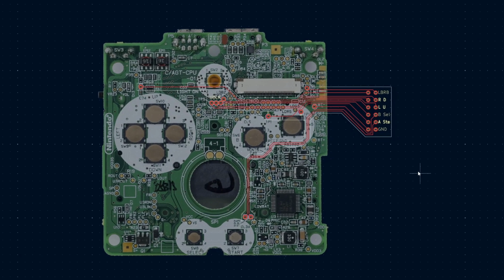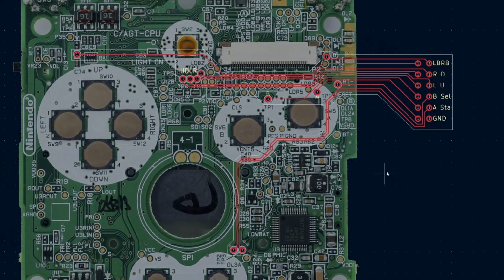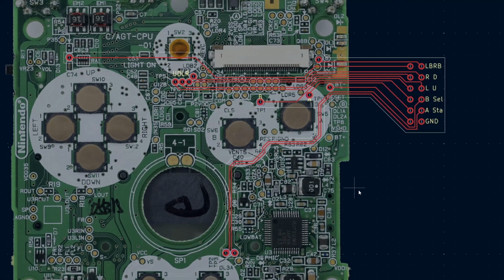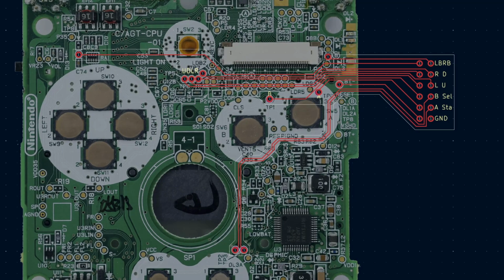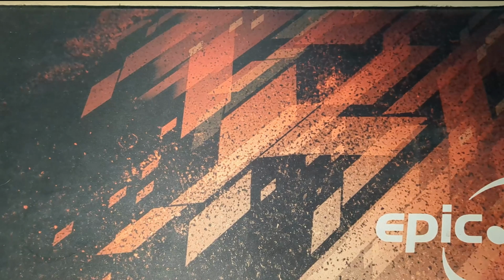Each of these pads over the console is a simple solder point that I just have to solder down, and then on the other end I'll use little headers that plug into an external board that handles the signals from the Raspberry Pi. Brilliant. Now I just need to get these all ordered from JLC PCB, which is going to take a while, so it's lucky that I did this at the start of the project, and with a bit of movie magic, they'll appear.